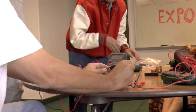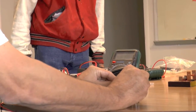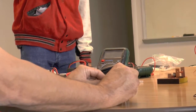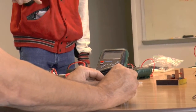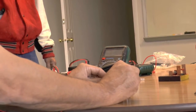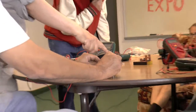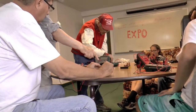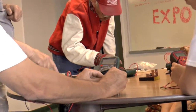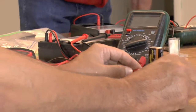We're reading about 23 volts because I gave him the battery that's no good, but that demonstrates you've still got voltage and it'll still accumulate. So if I needed 23 volts and I had one bad battery, I could still use it. They daisy chain together — batteries add up in series, positive to negative, positive to negative, and you can get more voltage out of them.